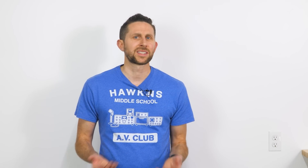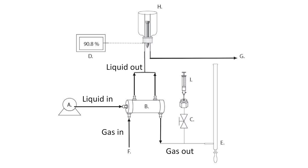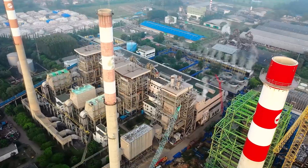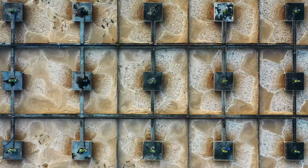One of the hardest parts about this process is that the bacteria live in liquid and you're feeding them gases, so you have to continually make sure that they have enough dissolved gases in the liquid. If you were to use this on a large scale, you'd set up your plant next to a trash dump, send the trash to be gasified, and then pump that gas into the fermentation tanks that convert it into the liquid fuel.